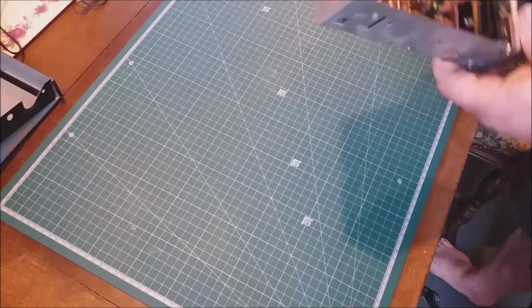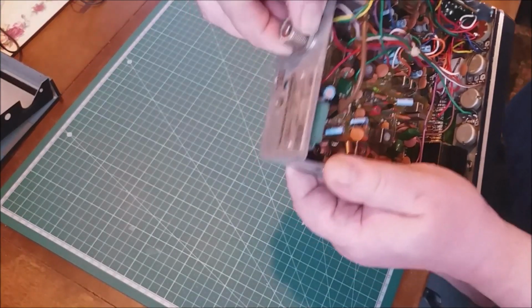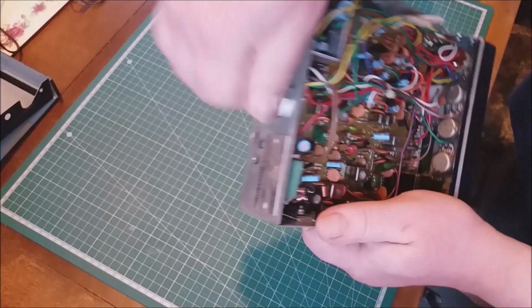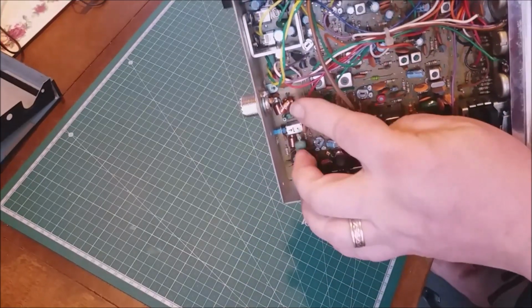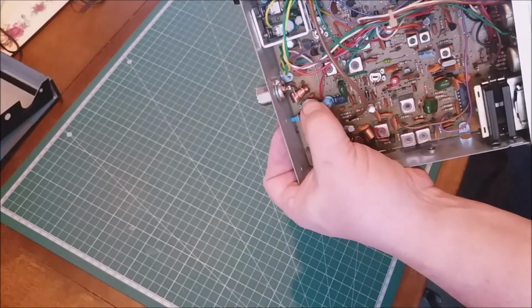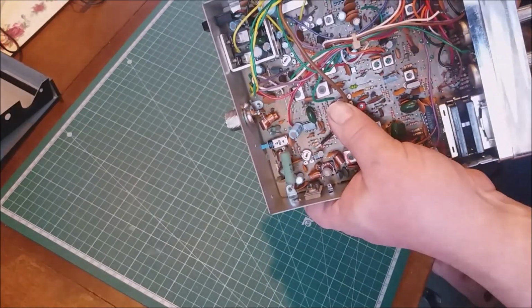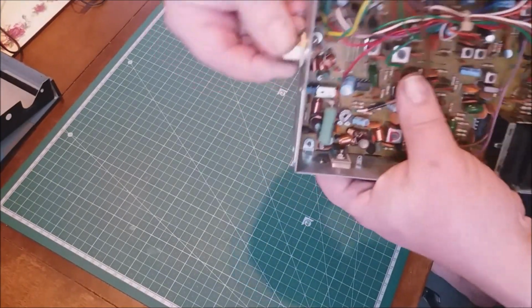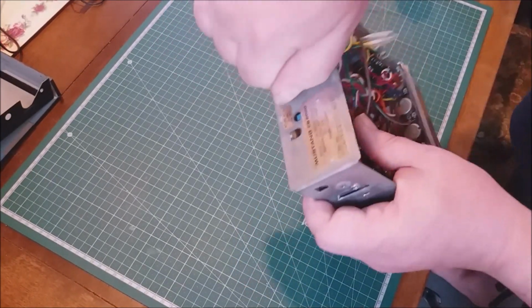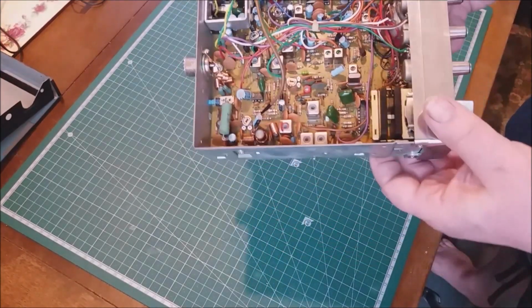The other thing that's always worth checking is the nut on the actual antenna connector. So many times I've seen these work loose and then they break away inside, and then sometimes you see where people have repaired it and they've stretched these trap coils as well, so you can see that there's been some disturbance, especially if the whole thing's been twisting around. Some of them are notched so they won't actually twist, but if they come loose you've got a bad ground connection for your antenna from the get-go.